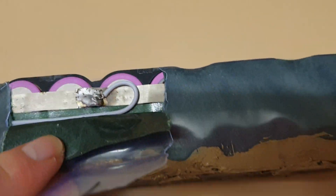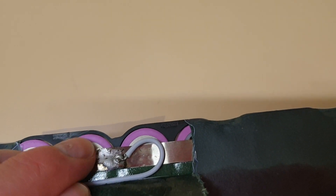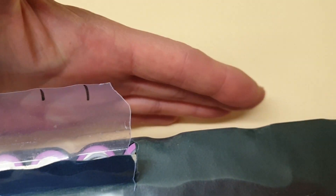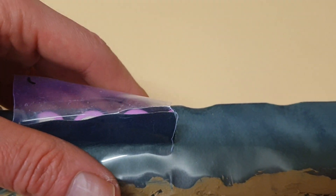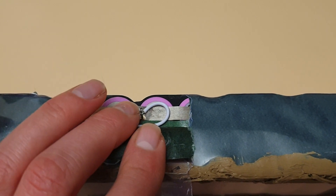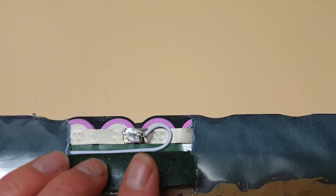My advice: definitely open both sides and check. I will solder a strip over here which will be loose to avoid this. But what you should do when you put the battery in the scooter and screw the bottom is definitely put some silicone or something especially in the middle to avoid this bending. This is a common fault and it's an easy repair. Thanks for watching.